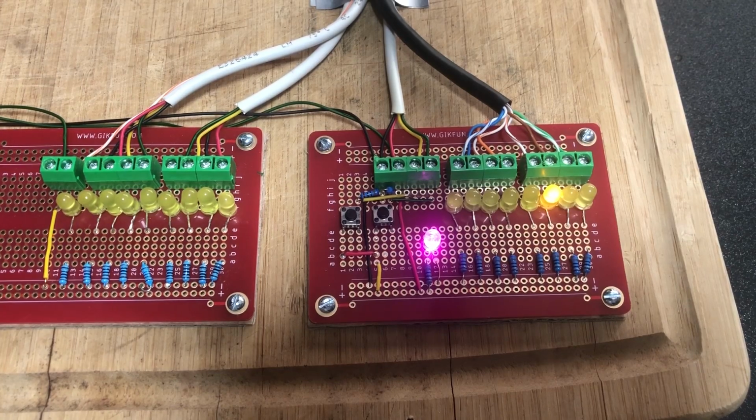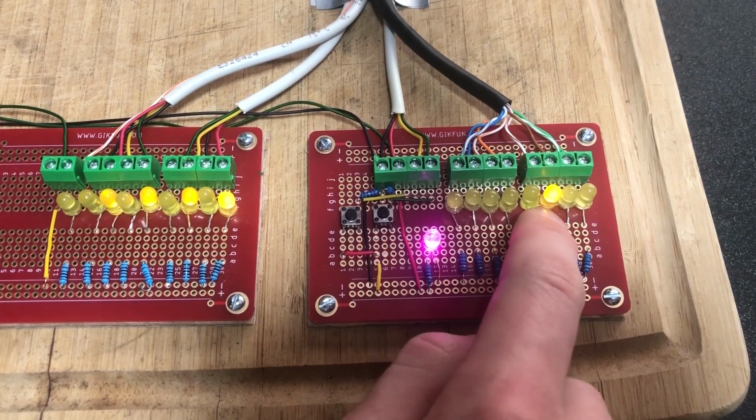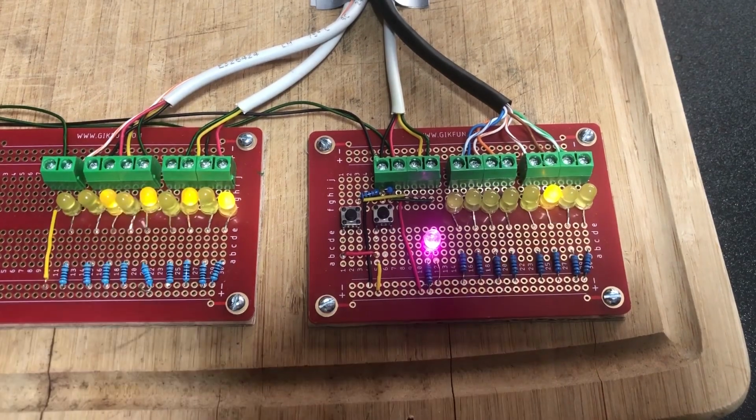The save feature mostly works. So let me show you. I'm gonna put some numbers in here, just kind of an on-off pattern. Now you can see right off the bat, this bit is on, this third one. It's not supposed to be on. This bit is just stuck. It's a stuck bit. There might be an error in the wiring, although believe me, I've checked and I've looked, I can't figure it out. So that bit's always stuck on, but let's save it.